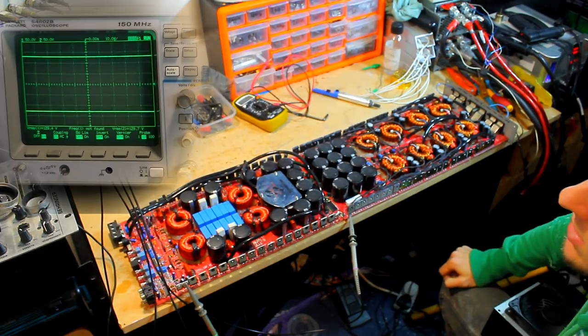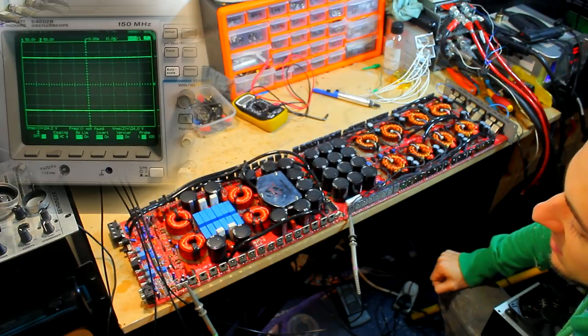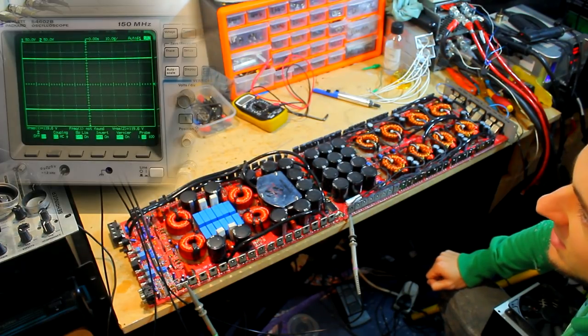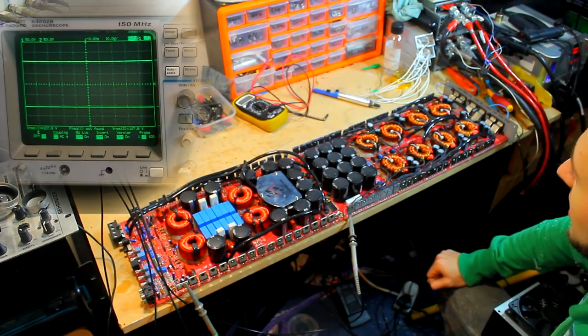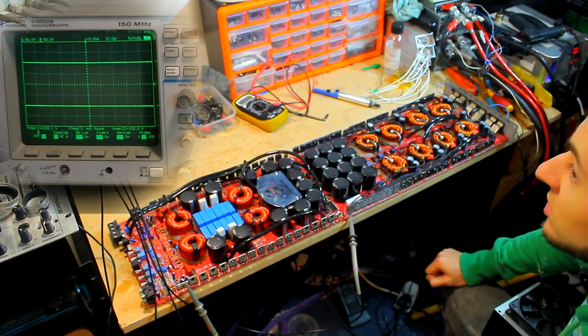Cool, well that seems to be okay. I've got 130 volts there, on the output of the positive rectifier and of the negative from the rectifier. Okay, cool. So I'm going to wait for that voltage to sink back down to safe levels through the pull down resistors on the output rails, and then I'm going to fit the driver board back on. I don't know, fingers crossed, we may see this amplifier fire up and switch full duty cycle, fingers crossed.